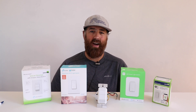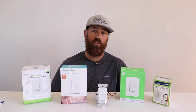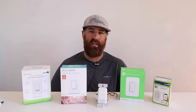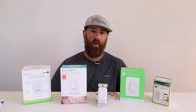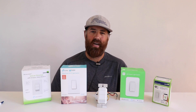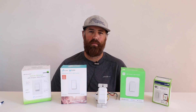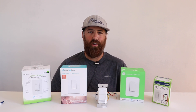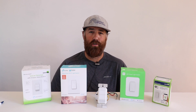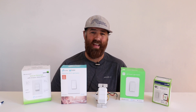Now the second most common thing — and I am guilty of this too — is that people have trouble connecting to their Wi-Fi network with their smart switch because they're using the wrong password. Make sure you double check this. Log out of the Wi-Fi network, try to connect it manually on your phone, entering the network name and password just to be sure you've got it right. Write it down and then retry connecting your Wi-Fi light switch. I've done it myself — you get sidetracked, or you change your network password and forget the new one.